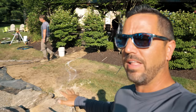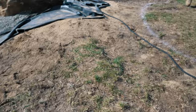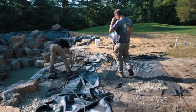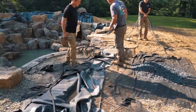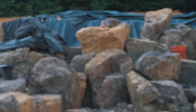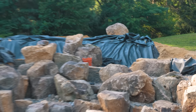Today is a big production day, and when I say production, I mean we're going to get a lot done. I've got the whole crew here — Boley, Brennan, and Drew showed up this morning. They're going to get rocking on carving out where this flagstone patio is going to be back in here. We've got a really nice pavilion out there, and we're going to have a walkway made out of flagging coming out here to meet the pond. We'll break off to the left here, go over to our beach, with a planting area in between. Off on the right is going to be a big circular fire pit. We'll be cutting in that flagstone around some of the boulders we laid inside here already. We're also cantilevering over this wall about an inch or so for a really super clean edge. Meanwhile, we're going to get rolling on the waterfall, finish framing out that right side, get in some frame rocks, then pull that liner back and dig for our constructed wetland filter. That wetland filter is what's going to keep this water quality perfect. Don't forget — today we've got the water trucks coming, so this will be full of water today. Let's go.